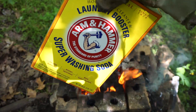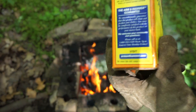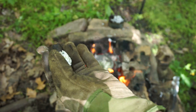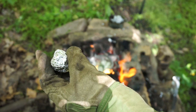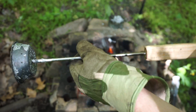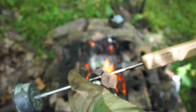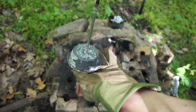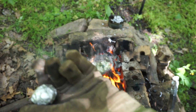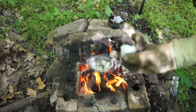Now we're going to be doing some degassing. This is what my friend uses, which is washing soda — sodium carbonate. I've wrapped about a teaspoonful, maybe two teaspoons, in a piece of aluminum foil. We're going to throw that in and then use this tool I made, which is a metal rod with a muffin tin on the bottom with a bunch of holes in it. I'll push it to the bottom — it will decompose and bubble up through it, the gases, and supposedly absorb all the hydrogen. My friend has been doing castings for years, so we'll see how it goes.